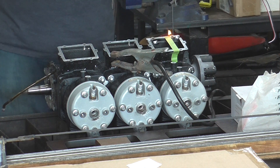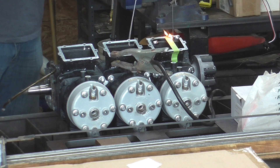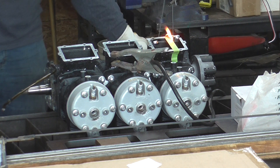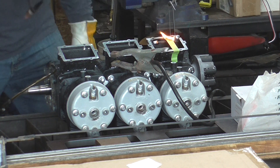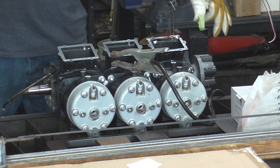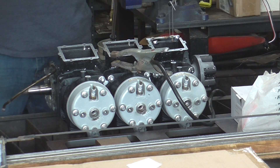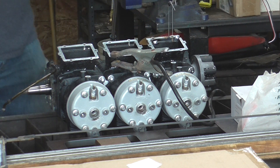Here I found out that this casting is very porous — a lot of black stuff coming out and it's really hard to weld. It's still working out pretty good though. Luckily, because the cleaning action is up so high — the balance is at 48 — I'm getting it to work all right.